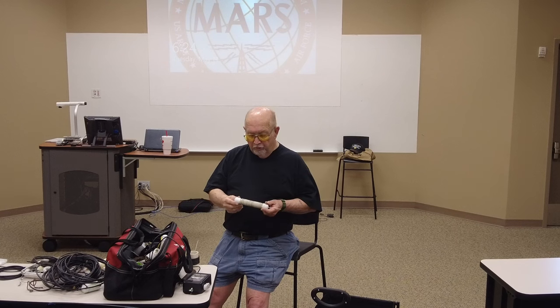Okay. I just wound this one the other night, so it's not hard to do. This is solid number 14, and that's what you ought to use to wind this coil, because stranded won't stay good and tight like this. And that's not as tight as I'd really like it. After you get one built and get it up, you can varnish it.